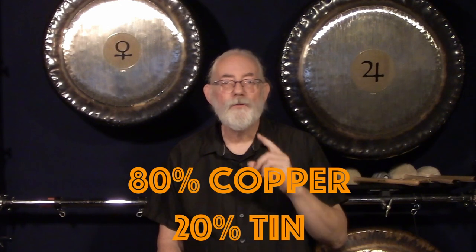Let's get back to bronze. Bronze is basically a two-metal alloy, tin and copper. The alloy we are most familiar with is what has been termed bell bronze, because it has been used in Europe for centuries to make bells, like the giant church bells that we see. Bell bronze is basically 80% copper to 20% tin, give or take plus or minus 1% of tin. That's the basic alloy, and it's called B20. The famous Zildjian cymbals are made out of B20 bronze, a formula that the family has held for 400 years.